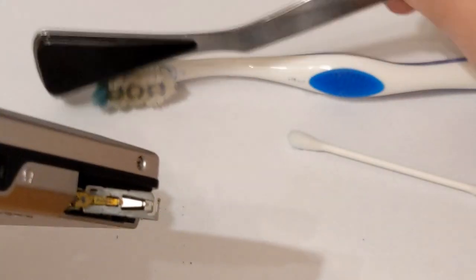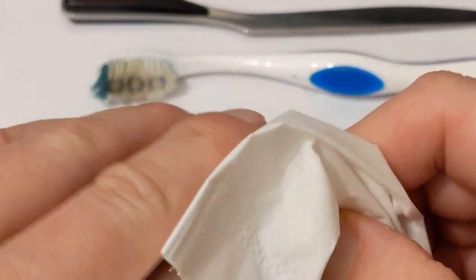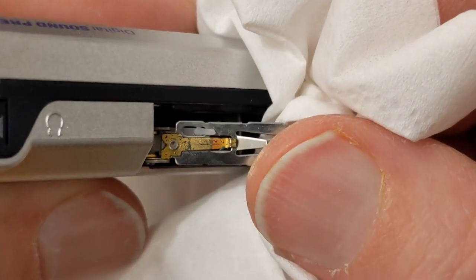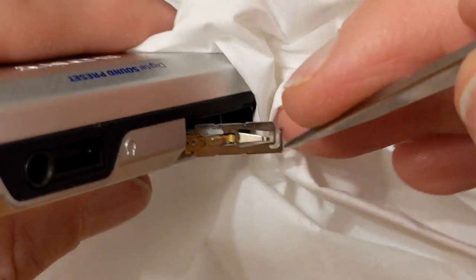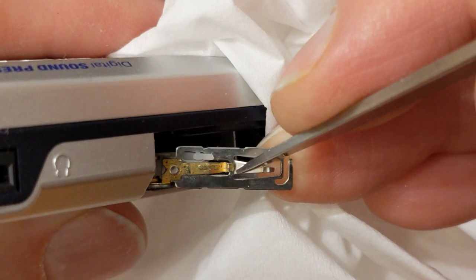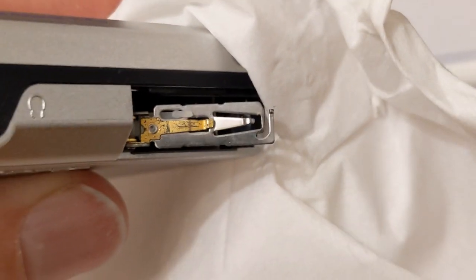I think that's clean enough. Now we've got a situation where that is covered in vinegar which is acidic — so we've got rid of the alkaline which is corrosive, and now we've got it covered in acid from the vinegar, which is a bit stinky at the moment. That's looking nice and clean now. You can probably see there's some corrosion where the gold has been corroded away, and I could see another little spot there. I'm watching this on a five and a half inch phone screen — that's what I'm recording on. I did actually buy an approximately 17-inch external monitor and figured out I can stream the video I'm shooting onto it and see it on a big screen. If you're watching on anything bigger than a five and a half inch screen then you can see more than I can.